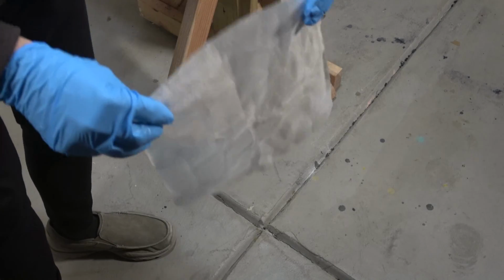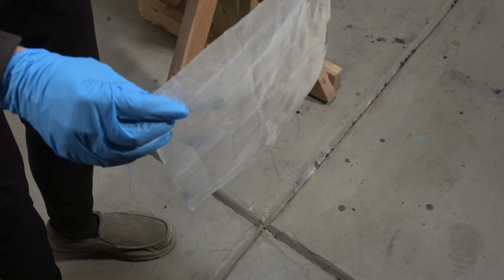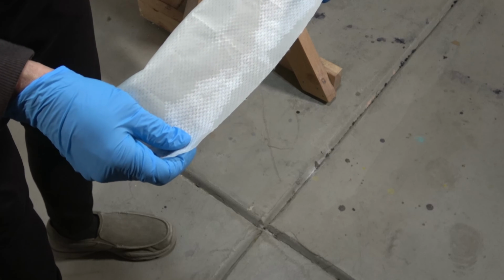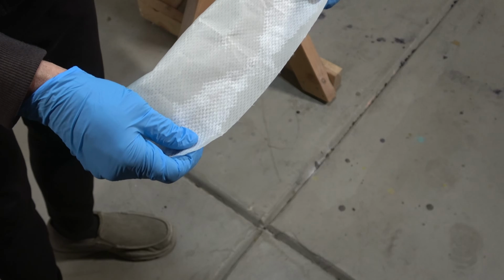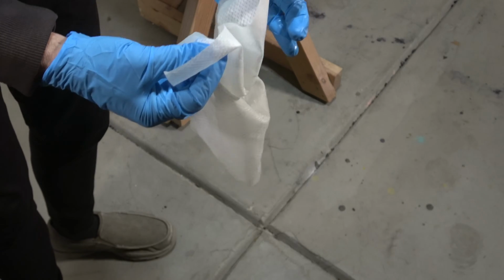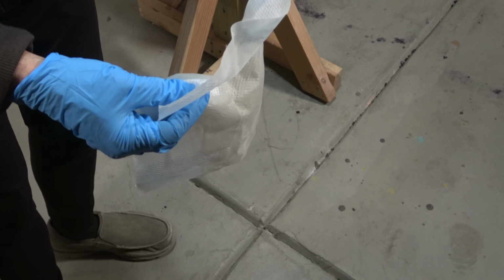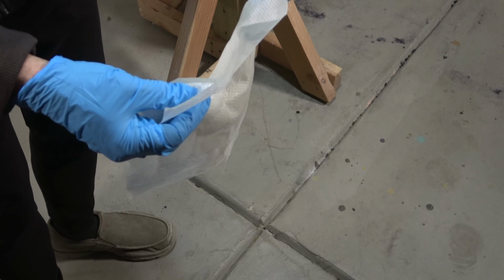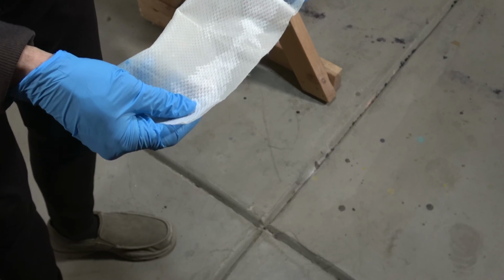Now, one thing that's really important to understand is the proper disposal of oil-soaked rags, because as that oil is drying, it can generate some exothermic heat. So if you have a bunch of oil-soaked rags all clumped together, that heat can be enough to spontaneously combust. And I've seen way too many garages and workshops burn to the ground because of the improper disposal of rags.